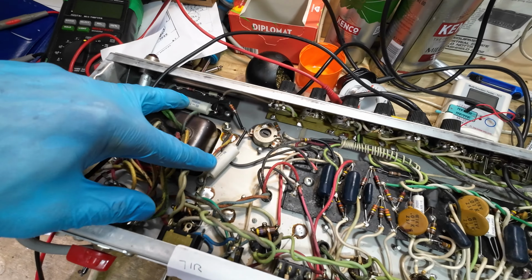So if we look at this part here, you can see we've got this swishing sound going on, scratchiness, and that's because of this DC leaking onto this pot. And if we just go in here, you can see we've got a quarter of a volt there. We had as much as half a volt yesterday. So maybe this board is drying out a little bit. But now